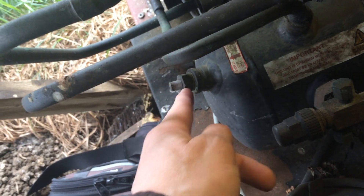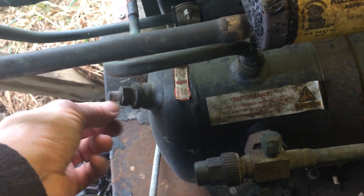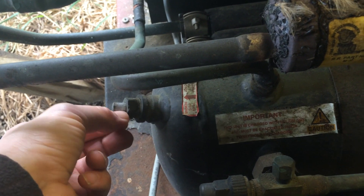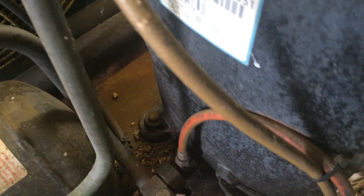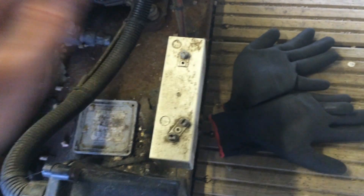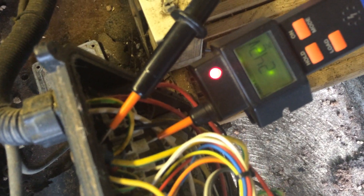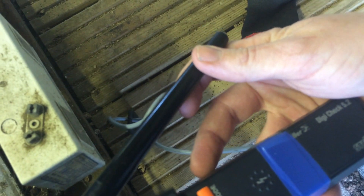But looking at the state of that fusible plug, the solder should be flush with this — it should look like that. So that's pushed all the way out. Chances are there's cobwebs on there; it might have been like that for a while. Let's get in and check the pressure switch. It appears to be off on this pressure switch.